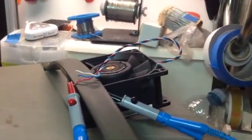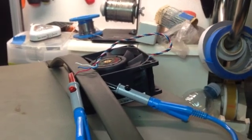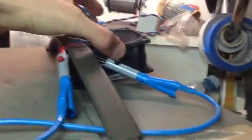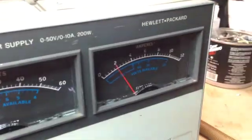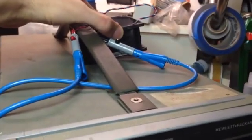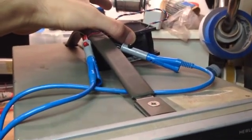The resistor was a bit of a failure, so I decided to step up a notch and plug in this fan. It's a fairly special fan - it runs at 12 volts like all the others, but it takes 2.8 amps, and it moves quite a bit of air. My voltage is down, current is midway, because I want to try current limiting it. Let's fire it up. The fan is just starting to spin up. Wow, that's a big fan. I got 2 amps. Unfortunately, I cannot try current limiting it because both of my hands are full, and if I let go, there's a big chance that this fan is going to fly off and destroy something. The safest thing to do right now is to turn the power supply off.